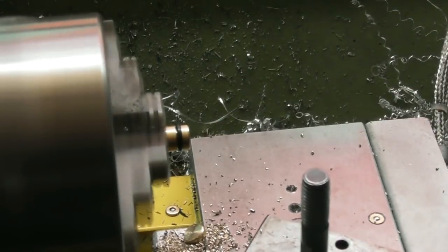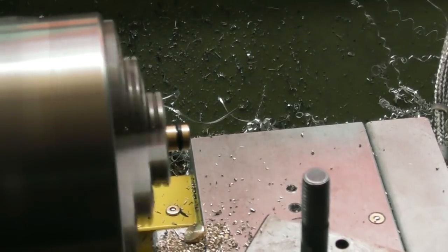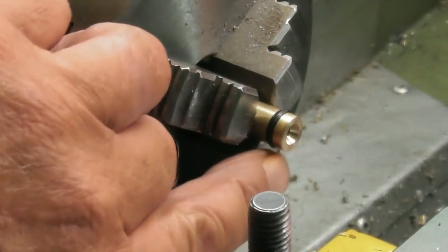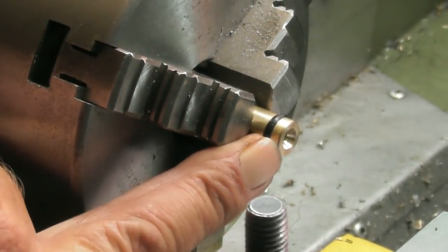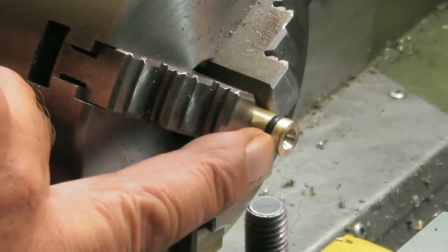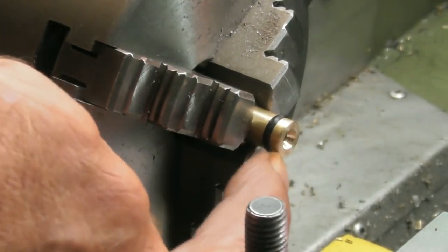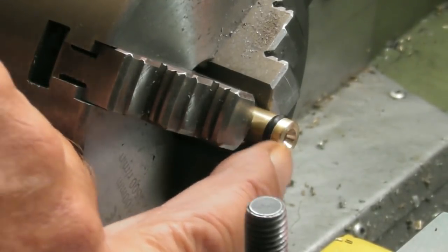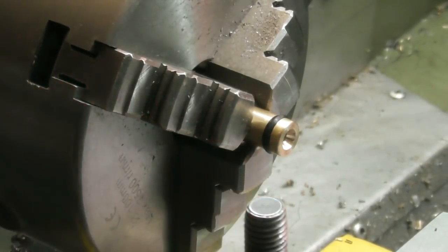I think maybe another 0.5 mil. Well, it's 6.5. I'll give you a shot of the end of it. So there's the end, drilled out with a BS3 center drill, and I've gone 6.5 mil deep. And that's given me a pocket, probably 7 mil diameter on the outside of the taper, and obviously the pocket. Now, our char cloth will be put in here ready for combustion.